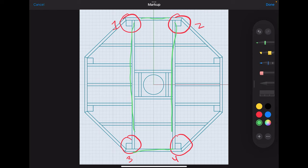So I cut them the right distance, attached them all, cut them the right length, attached them all, and they're to hold the posts the correct distance. Now, from here, I actually concreted post four next, because post four holds the squareness of this whole layout. So I basically took post four and I laid it down. I measured my diagonals. I got things squared up and I sunk post four and concreted it.